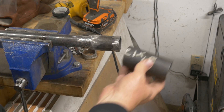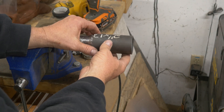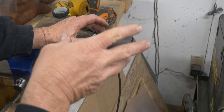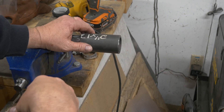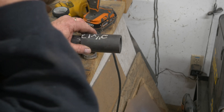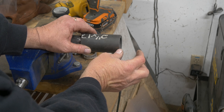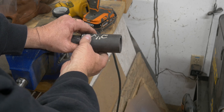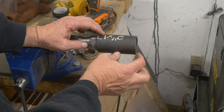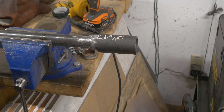Alright, last test. This piece here will be mounted to the furnace wall and will slide into it. I'm going to put this on here to simulate what it's going to be like going through the furnace wall. Ideally I want this piece to be flush with the end of this pipe so it doesn't get too hot, but there's going to be about an inch to an inch and a half of furnace wall sitting outside of it — so I'm simulating that, as this would be the refractory cement tunnel that the flame is going to go through.